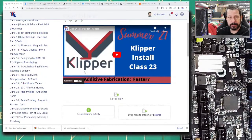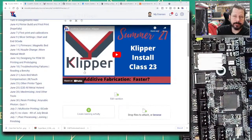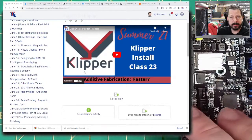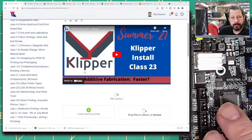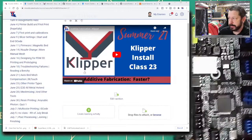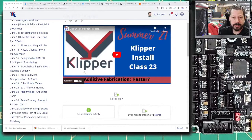So you can take Klipper, take all that processing away from the board here and put it out front in a Raspberry Pi, which is a computer with significantly more processing power than even a modern board, and let the processing happen on the Raspberry Pi running Klipper, and then all your board in your printer does is execute the command. So it turns the step, it still has the stepper drivers in here, and it still has the fans and the limit switches and everything.